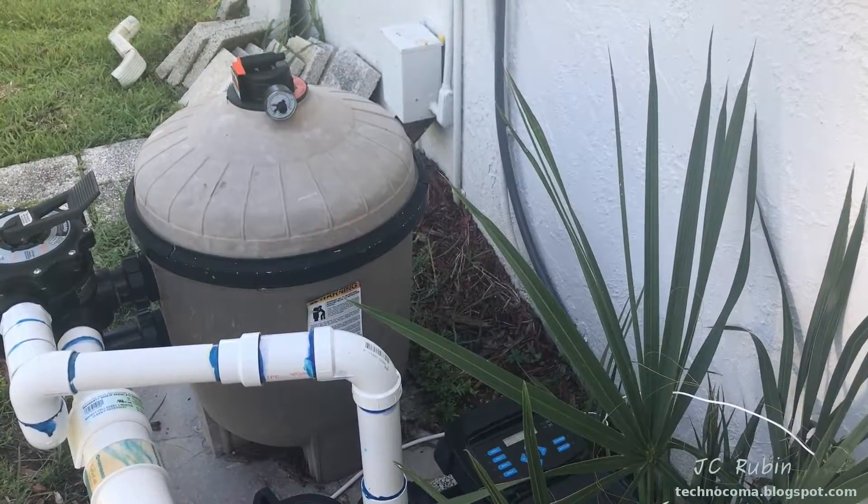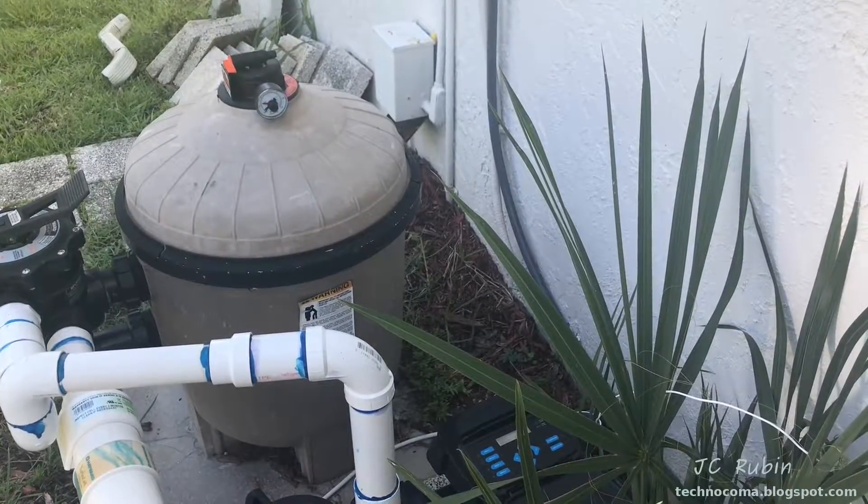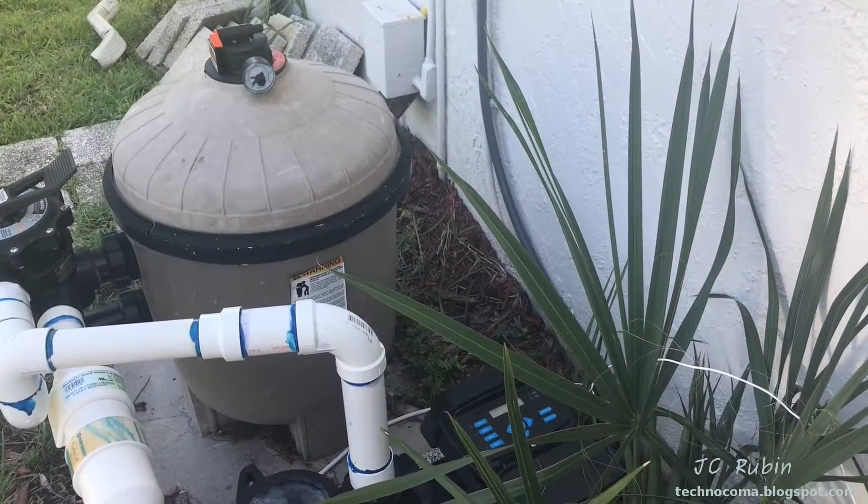What I want to do is record the pressure of this canister after the rebuild, before any DE is inserted, as a control and keep those for my notes. At 3250 RPM I'm seeing 7 PSI. At 2500 I'm seeing 4 PSI. At 1750 I'm seeing 2 PSI. At 1000 I can't read it. I'm going to let it sit at 2500 for a few minutes just to monitor everything and make sure everything's okay.